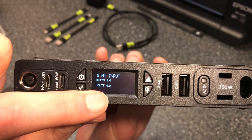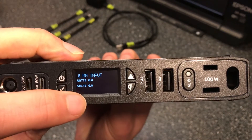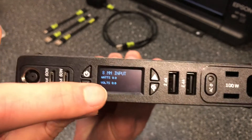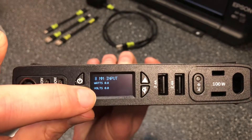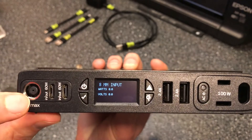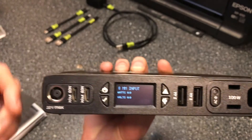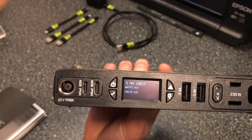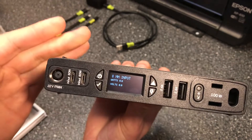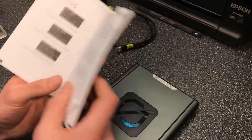With efficiency losses, you'll get about 40 watts maximum from a 50-watt panel. If the reading is only at 30 or 35 watts on a clear day, you can adjust the solar panel angle to maximize wattage coming in. Watching this meter while adjusting the panel angle will get you the best position and fastest charge. At 50 watts, this unit takes four to eight hours to fully recharge — the fastest solar charging I've seen on a power bank.